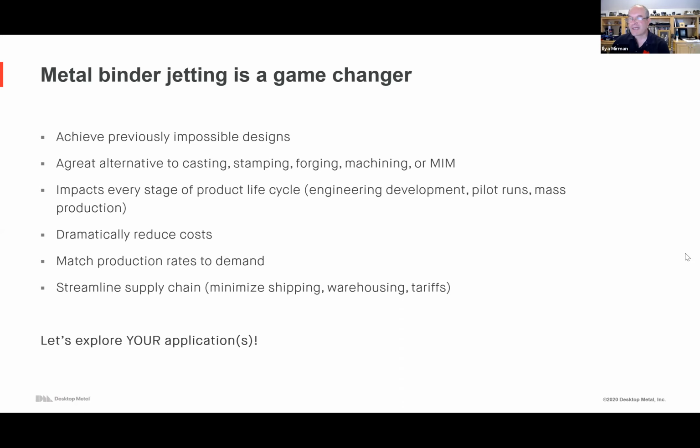All right, it looks like a lot of waste in the studio with very large brims. Why is that? Yeah, the studio is not a way to make high volume, cost effective parts. What you saw was a very high aspect ratio part, a very long bus bar, and we wanted to print it centered on a large flat plate. Most parts are different. For example, here's a heat sink I didn't show, and here's the platform it gets printed on. The support is essentially a little plate the size of the part. Not a lot of waste here. Most of the part is the heat sink itself. So really it's part specific. That was an extreme case.